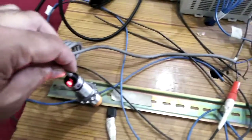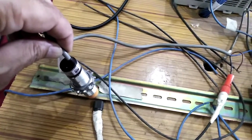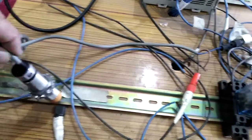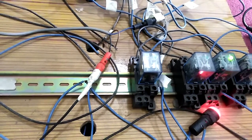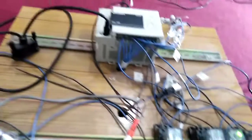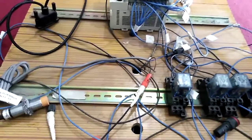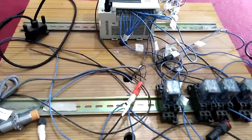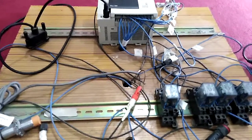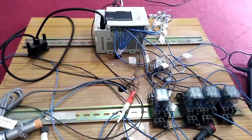You can also check this with metallic things. This is a metallic bar — when you bring the sensor closer to it, it will generate an output signal which will turn on the outputs Y1 and Y2. In this way you can connect a capacitive sensor, and utilize its output signal for various useful purposes. Thank you so much for watching this video.